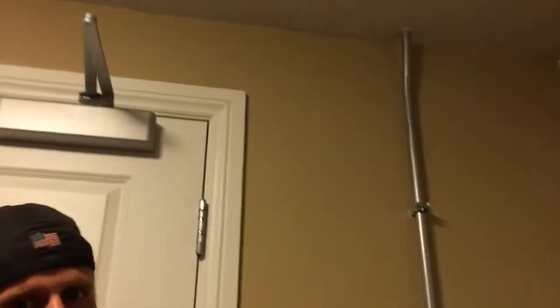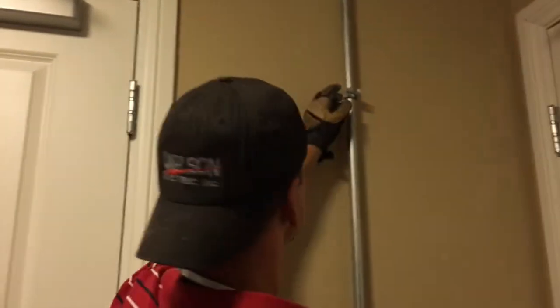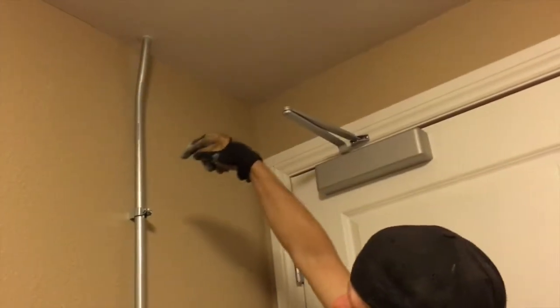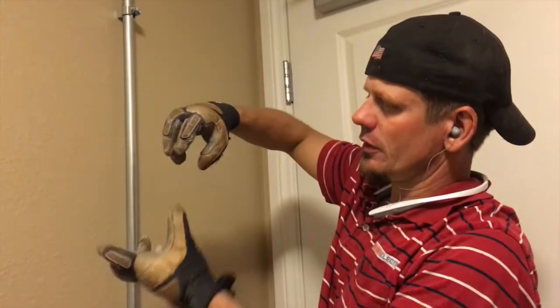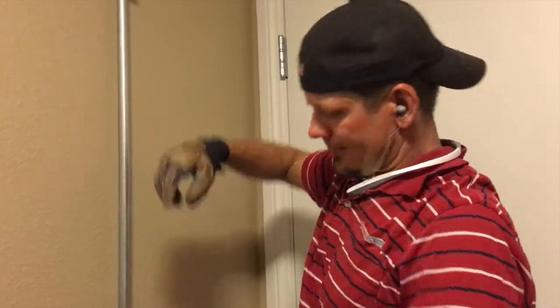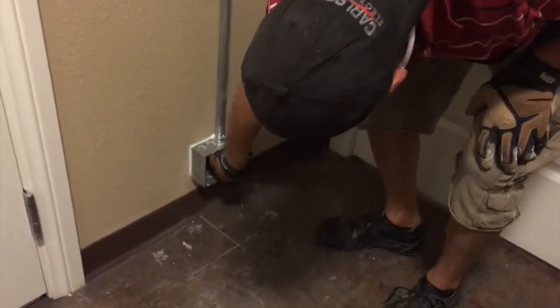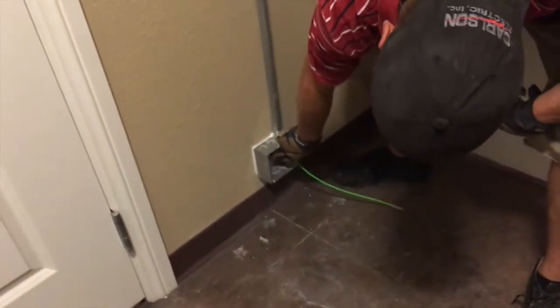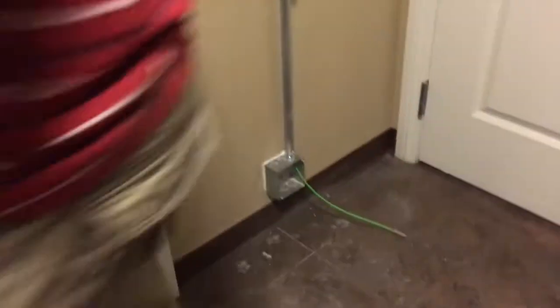There's an attic hole here and a double door above that, so this is like double-walled with double drywall - all because it's a retirement center. We flexed it into the conduit by using a flex connector to a rigid three-quarter inch coupling to a three-quarter inch set screw, and we could literally push that fish tape all the way down with no problem at all.